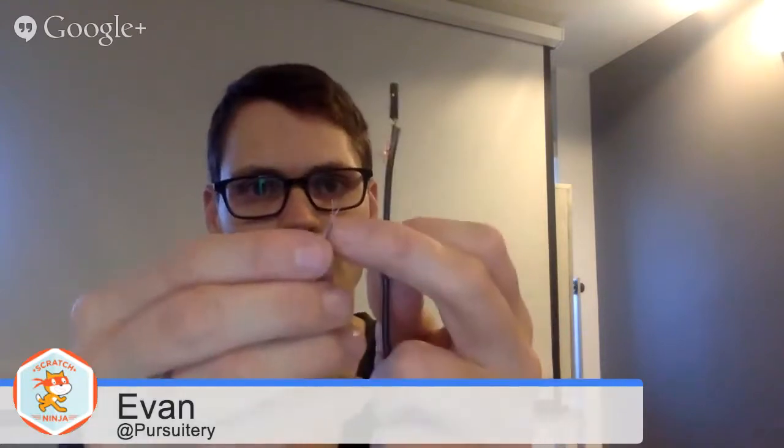Now, so I've got this part of the cable, and I have this part of the jumper. Let me go ahead and take a few of these away just because I'm not going to be able to wrap the jumper around all these other cables. And now, again, this is a very, very basic way to do it, but actually in this case, I went ahead and did away with all this and just put the cables into the jumper so that they would touch the unit on the GPIO. So let me do that again here, see if that works. So there's two parts of the female jumper cable. There's this part here, a little bit tiny and rounded, that's actually going to go over the pin, and there's this kind of big broad part here. So what I'm going to do is take this cabling, and this is again my jury-rigged way of doing it.